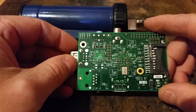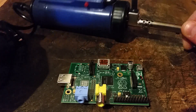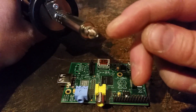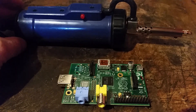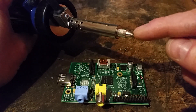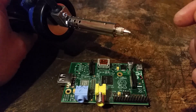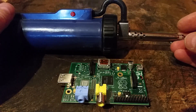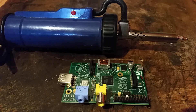It's virtually impossible on double-sided boards and just makes a mess of the board, risking damage. I recently found this tool on eBay — it costs £20, so it's really cheap. It's got a heated tip, a hole in the end of the nozzle, and a button. It's basically just an oversized solder sucker, but because it's mains-powered the suction is really good. You can place it vertically and suck the solder straight up into the nozzle, which makes the job a lot easier. It's still a cheap tool at £20, so not a first-class desoldering tool, but from what I've used so far it does a good job.